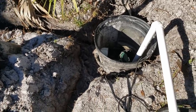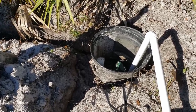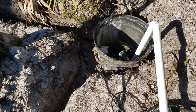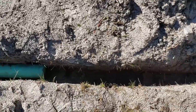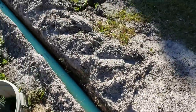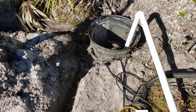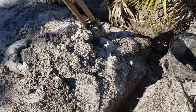When you're working by yourself, try to think about utilizing your manpower and energy. The question here is: should I go ahead and cover this up, or should I go ahead and lay more pipe? I like to get more pipe laid so that you cover it all up at once. We're going to trench this line out right below my feet to make sure we're at the proper depth and hook up the catch basin over by the driveway, then plumb it all together.